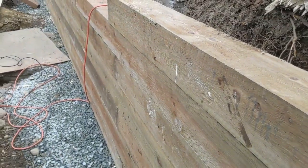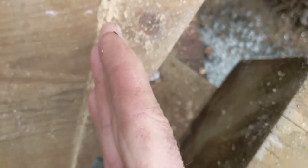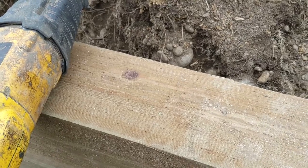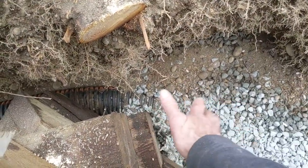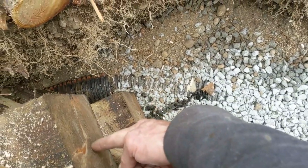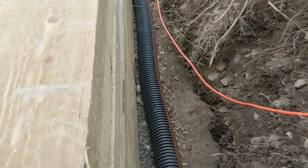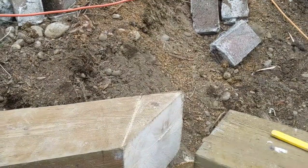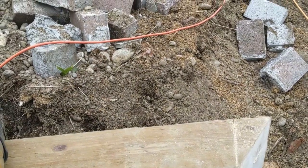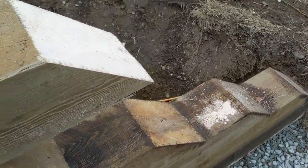Yeah guys, I'm here at my retaining wall going. Like you guys can see the corner here — what I do is see a line on this side, then I align on the other side too, grab the square, and mark another line. Because this one I just want a nice cut, because this one might be exposed once we do the paving. Then all the time we treat the end of the wood, that way it doesn't rot at every cut. I'm gonna cut this one. Like you guys can see, we have it braced up, even the corner down there. This cut we have at 45 — if we cut 22 and a half on each side. I just want to make sure this is nice and tight, and on the corner here, just make a kind of little step to lower it down.